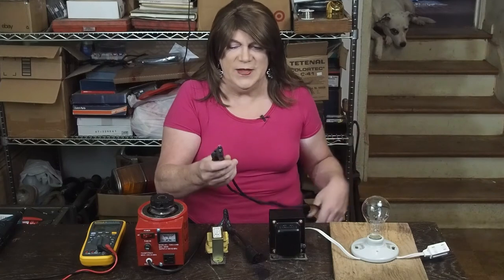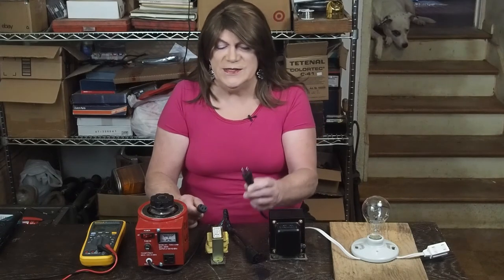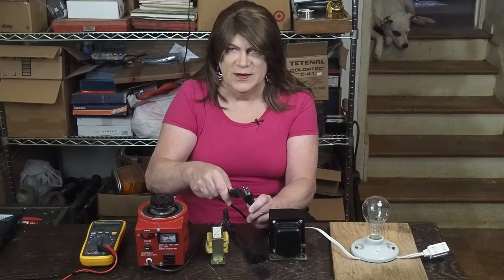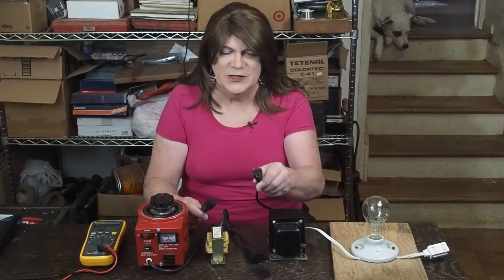The last piece I have is a cord I use when testing an amplifier — a regular three-prong IEC connector with the ground pin removed using a pair of pliers. Only use this when testing. Don't use this as a solution for hum issues — lifting the ground is not the way to fix hum. You need to find what's causing the hum. Operating an amplifier this way permanently is totally unsafe.